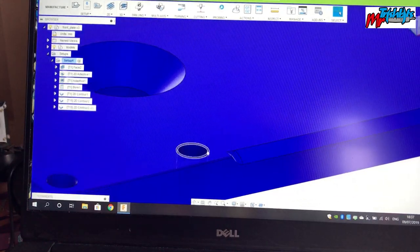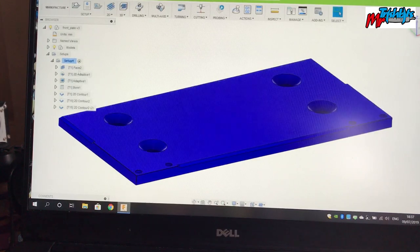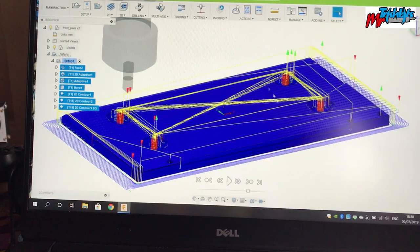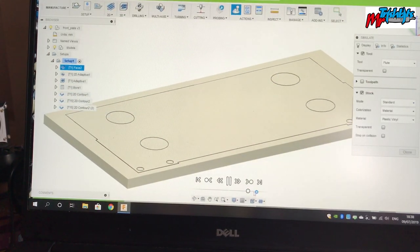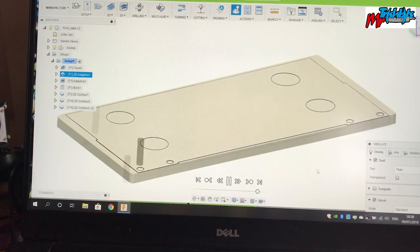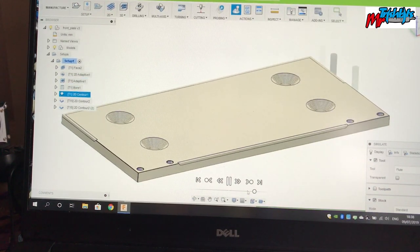The main tool I'm going to use is my 2-flute 4mm carbide cutter from Rennie Tool, and that will do all the work, including some adaptives to create the conical cut for the countersink. Then I'm going to use the 90 degree CNC spot drill to finish off the countersink, clean up those 45 degree edges, and then just run around the outside and clean them up. So it's pretty simple. I'll leave it with you. You can see what it's doing. You've seen it before. I don't need to explain the same thing over and over again. And I'll speak to you in a sec.